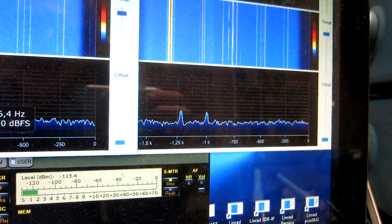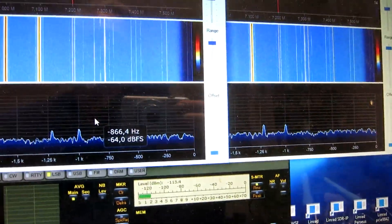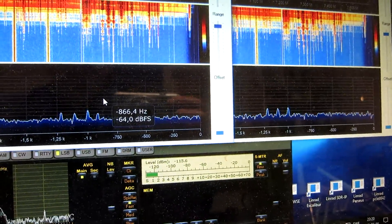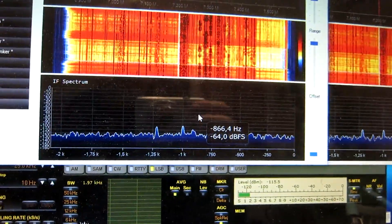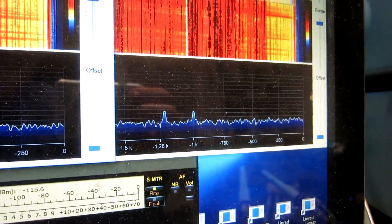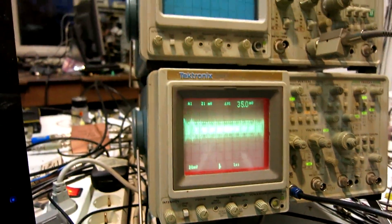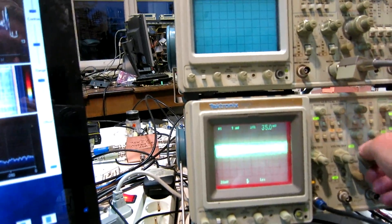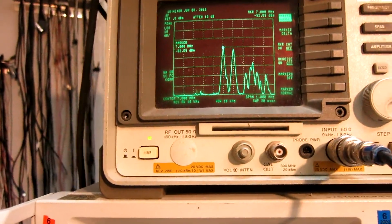So I take some kind of average between them, and add antenna signal. We have saturation here, and this one is a little bit less saturated. The two tones are not visible. So this is third order intermodulation, and the level is minus 32 dBm.